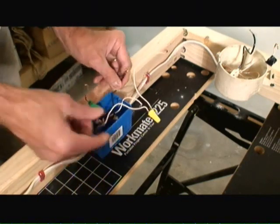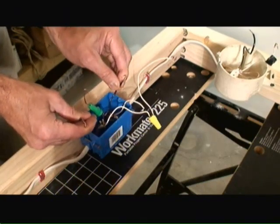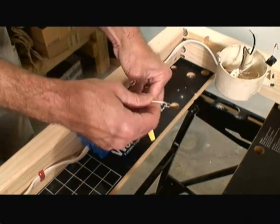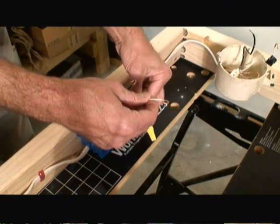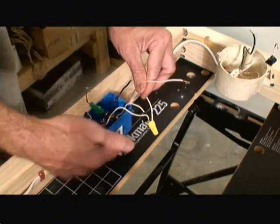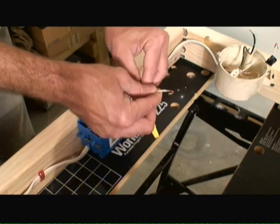In addition, I have power that will connect to the outlet, and I have a feeder that will go up to the light. All of the return wires — the white wires — the one wire coming from the light, the one white wire coming from the power feed, and I also have a pigtail wire that'll connect to the outlet.